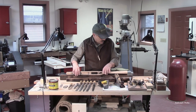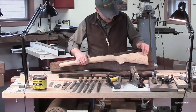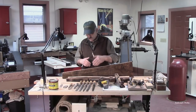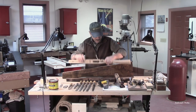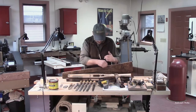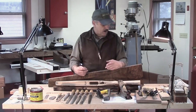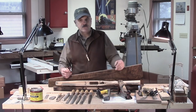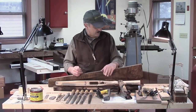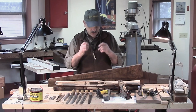Once we've got it all laid out, there's just a whole lot of extra wood on these blanks if you buy them well, and we've got to get rid of that extra wood. Sometimes there's extra width well in excess of what we need for minimum dimensions. I'll slab that excess wood off, and I've been known to use that little piece of slab as a top for a guitar. We don't want to cut this stuff away and throw it away — it's gorgeous wood with value in other places: inlays, guitar tops, so many opportunities. You pay enough money for these blanks, so getting as much use out of them as you can is valuable to you as an artist.